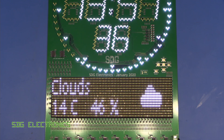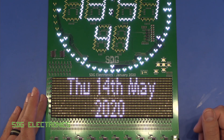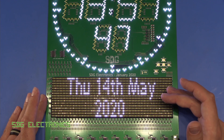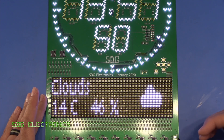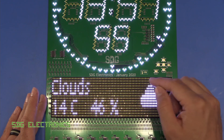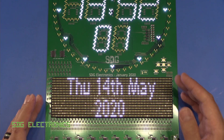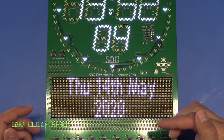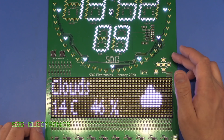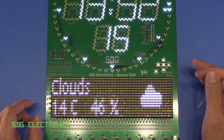I've been playing around with the ESP32 quite a lot since the start of this project. Previously I had no experience of it and it's been quite a steep learning curve. What I've found is it's not very good at low level control of hardware like we're doing in this project — it's okay if you've got other devices offloading some of the processing. What we've got here are tasks that need to occur at very strict intervals and each of those tasks is quite labour intensive. What I should have done is have either a separate PIC or other microcontroller on the board dedicated to the multiplexing of the display, or use some dedicated hardware driver chips.